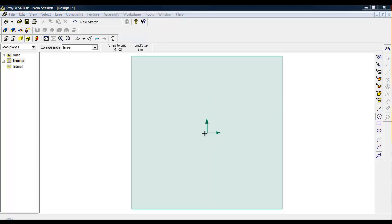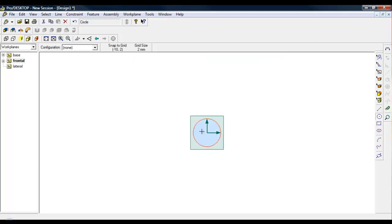The next stage is to do the profile of the circle - I'll just click into the centre and draw this around. The external diameter of the actual bike frame is 40mm, so I'm going to do mine at 44mm, which gives us a 4mm space we can use for the rubber strip. Then from the centre again I need to add the thickness - if I add 44 and add 2mm onto each side that makes it up to 48mm. This one's showing 52 which is slightly more than we need, so I'm going to click onto the sketch dimension tool.